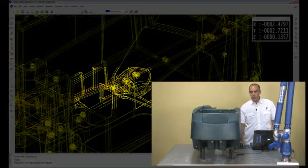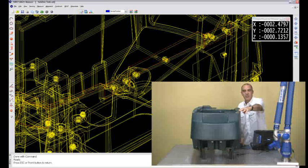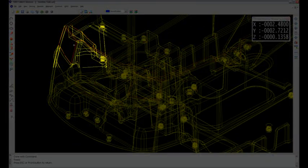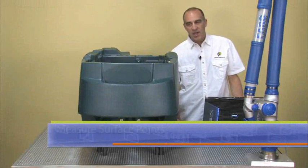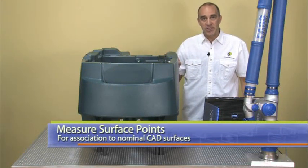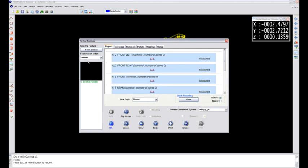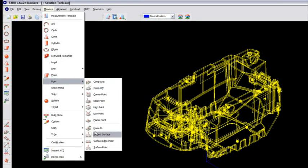The B datum are surface patches that solve for side to side — plates or surfaces where plates for hinges will mount. And then off the front of this solution tank, you can see a couple little red patches in the front corner here for fore-aft, and right there as well for fore-aft. The key to the iterative alignment is to use surface points in this situation. If you haven't gone through that module yet, hit that as well because it's very important. Let's go to measure, point, and then surface point.